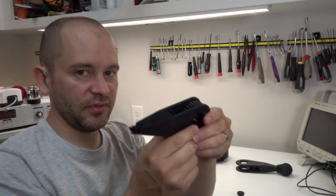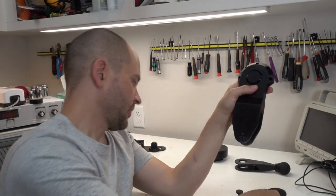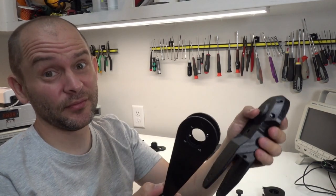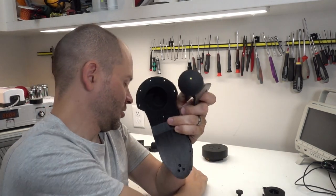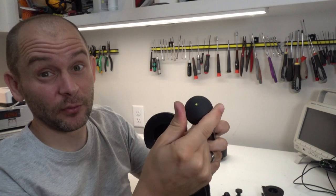The big annoyances are having to print the lower leg in PC Blend, and also the overall leg size is less than I would like for the Quad A1 — it would ideally be a little bit longer. However, given that it was already failing, it didn't make sense to make it longer. So what I wanted to do was revise the leg so it requires less support removal, so I don't have to print the lower leg in polycarbonate blend, and to make the foot replaceable without having to change the whole lower leg.